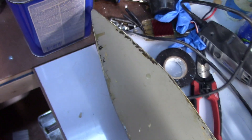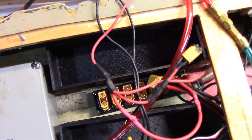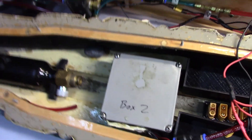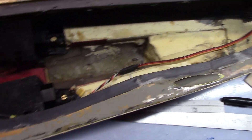The pump ESC would go right about here, and it has to be level enough to go under the marker or the sunlight holder. That's Kongo — the bow is really narrow, so the bottle goes to about here and there's a good bit of the bow that's not usable. Other possible arrangements would be to try to get the bottle between the batteries, but the beam isn't quite enough to do that. In general, it's a pretty clean boat with just four guns for the length, but this should hopefully give an idea of what a capital ship internal layout looks like completed.